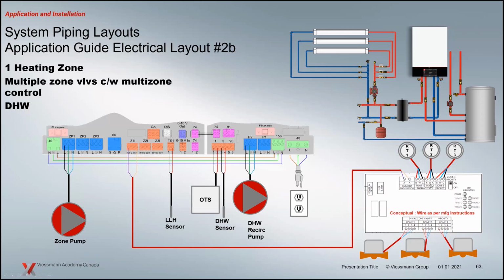You might have a zone panel there. Maybe one of these zones is a priority. You want to have it as a priority zone or something. Maybe it's not a heating loop here. Maybe instead that zone is a spa or something like that. So the time you want to use that, you want to dedicate all the energy to making sure that that spa is heated, then the zone panel might come in handy for that particular application.